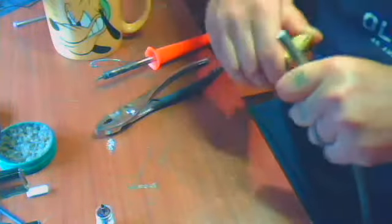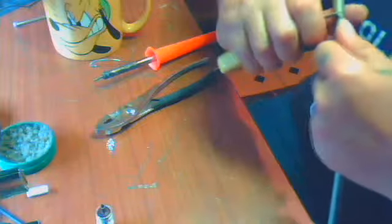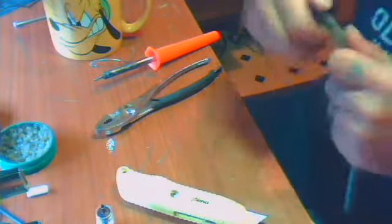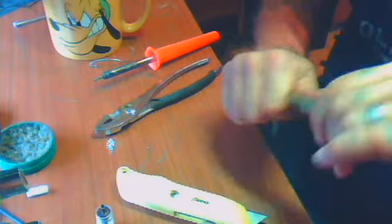This is some mean stuff right here. I forgot how tough the other end was. I should have unraveled the coax; that would have made this a lot easier on myself. You get it so far, just kind of bend it back. Make sure you didn't cut through that shield. Now if you're working with the black coax instead of this gray stuff, you can probably just grab a hold of it and twist it right off. But what I found I had to do — I didn't get it all — but that's better than cutting all the way through.